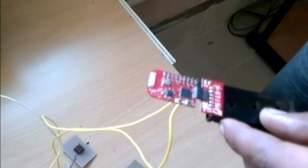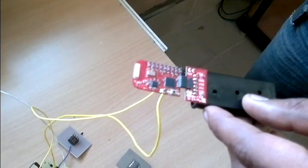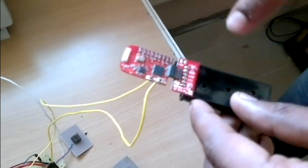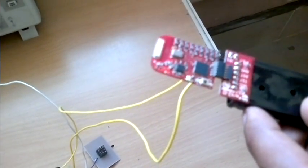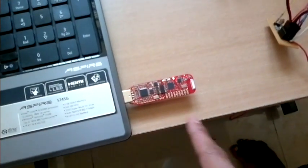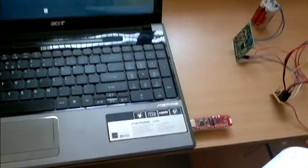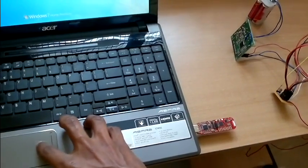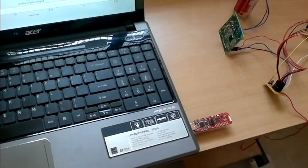The signal acquired by the electrode is highly distorted by 50 Hz power line noise, which has to be filtered in the digital domain. The digital signal is sent to the CC2500 via SPI from the MSP430 microcontroller. The signal is then received by the receiver IC connected to the PC. The receiver IC also has a CC2500 receiver and an MSP430 microcontroller, which receives the digitized data and sends it to the MATLAB software via the RS232 serial port.